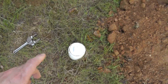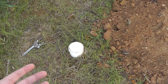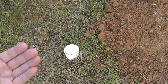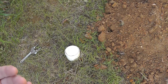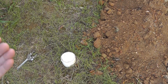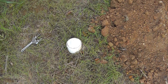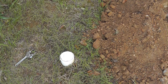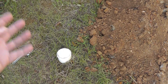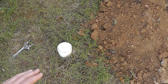The point of the video is: if you're draining a tub or the washing machine especially, and you have a septic system, and it starts to go slow or back up anywhere in the house — usually it's the lowest thing. If you're on a slab it's going to be the tub closest to the exit of the house where the clean out is. If you have a basement it's going to be the bathroom or sink closest to the clean out.